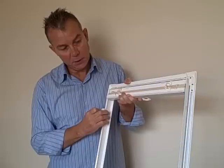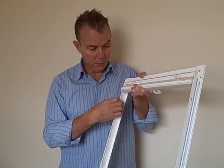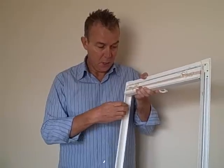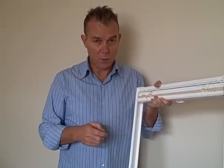There are four clips on this pleated side blind. To unclip them you just insert a screwdriver, depress the tab and the clip or the frame will drop out of the window. Do be careful with big frames obviously. So that is the clips themselves — they are very straightforward.